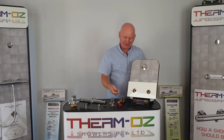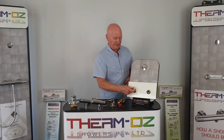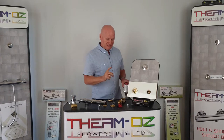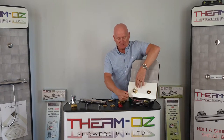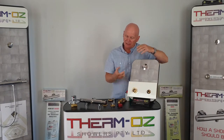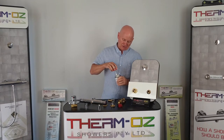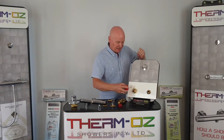You can see that's cut really nicely. So then back with the back plate and put on the olive. But the most important bit here now is not to make that compression joint dry — don't try and tighten that up now because you've got metal on metal, and there's too much friction to compress on that olive. So use a jointing compound or a thread lubricant — Loctite or something like that — just to take away the friction.